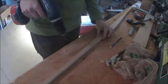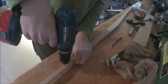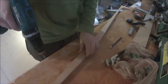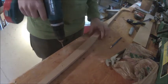When you have all your strips cut out that are the same width as the template piece, you're going to want to drill a bunch of holes through your template piece in order to attach them to the other pieces. This is very important because this is what you're going to have your router with a flush trim bit follow.